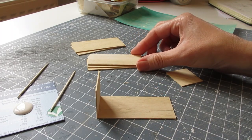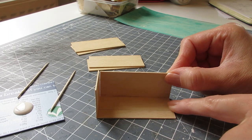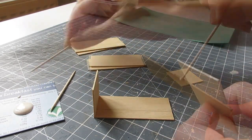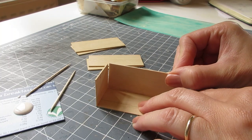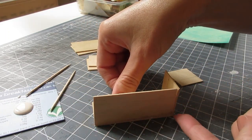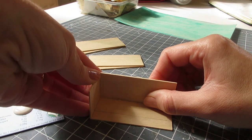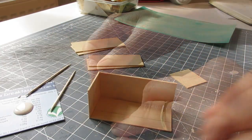Now bring in one of those three identical pieces — this will be our top piece. It's going to sit on the inside edge of the joins, flush at the top of the unit. Apply glue to a short and a long edge. Get your back piece lined up first so it's flush along the top of the back piece, then press it right into the corner. Pull the side piece in to meet it — see how that squares the whole piece off. Make sure you've got a nice flush line along the top, then give those a good press.